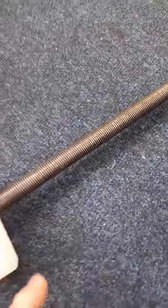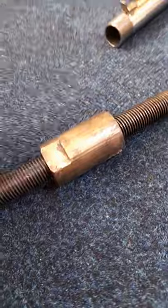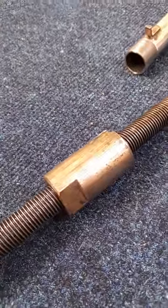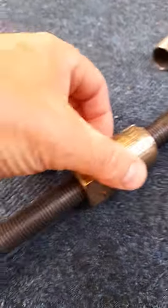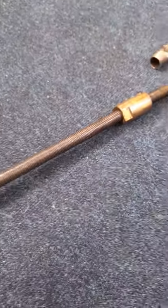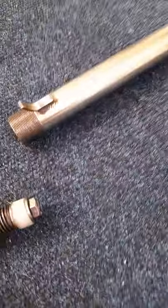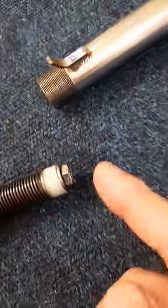There's the composite plastic piece. Here's the steel shaft with the screw, and this is the brass nut which I've cleaned up as well — you can see it's brass. Brass doesn't react with this steel, of course — that's why it's brass. This brass nut winds up and down the screw, and that's what lifts the keel. At the end you've got another composite piece, a couple of washers, and a stainless steel bolt, and if you undo that that's how you can get all these parts off the screw.